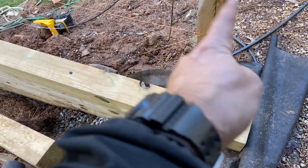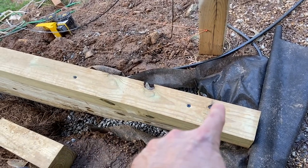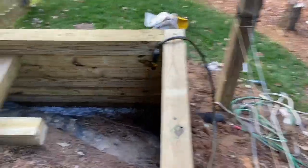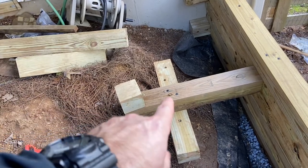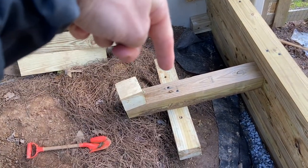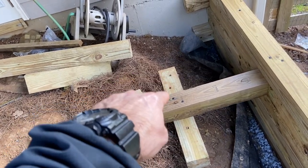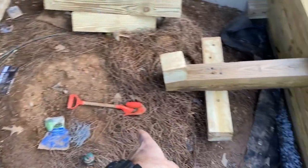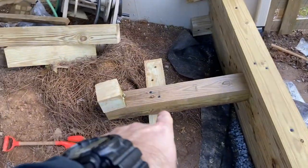That limitation is because when they poured the footing for this deck post, the post is mounted at the edge and the concrete goes all the way back in here — a lot of concrete. The timber wall is done. I've got a dead man here that comes back with a T, two timber lock screws, a two-foot piece of rebar drilled all the way through, and two more pieces of rebar. I didn't put another one in a certain spot because there's a corrugated drainage pipe running right in that area and I didn't want to spike through it.